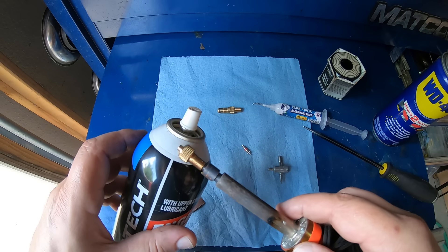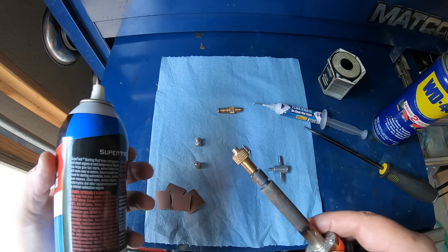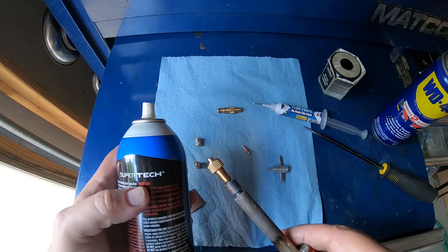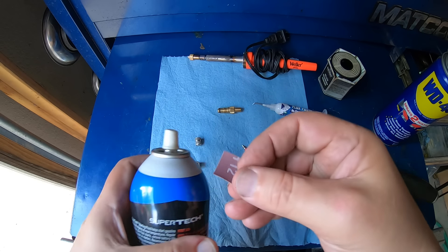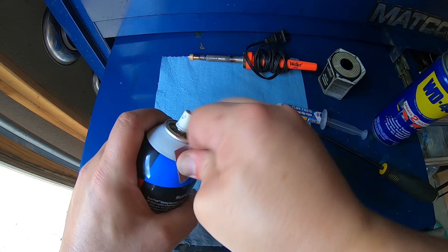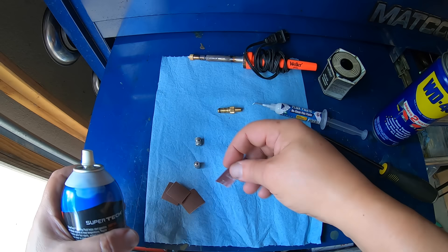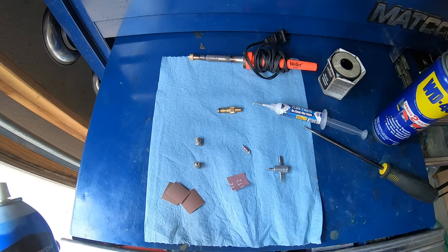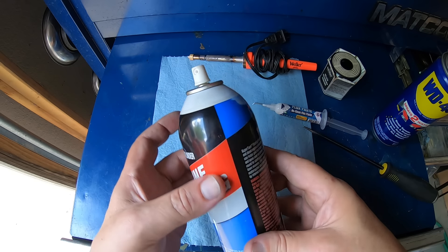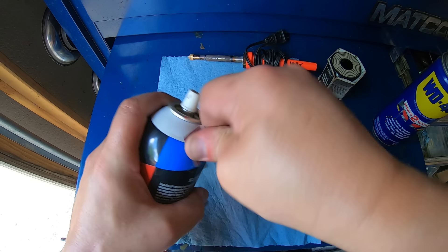The first thing we've got to do is clear off a little space on the can. This was originally a starting fluid can — pretty much empty. I'm going to put the valve right in line with the back. I'm using emery paper — sandpaper, steel wool would probably work too. I'm having to go through the ink, so it might take a while. Regular cans just have a coating that won't take near as long, but I want to do this one-piece can with the crimped-on top.